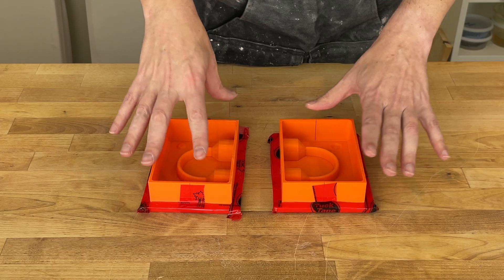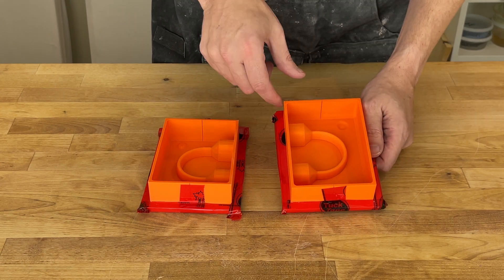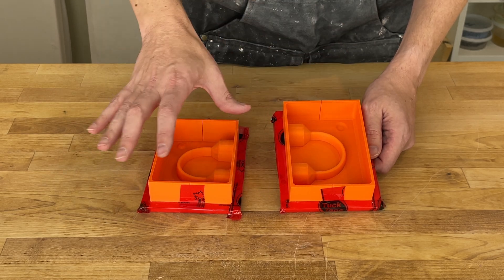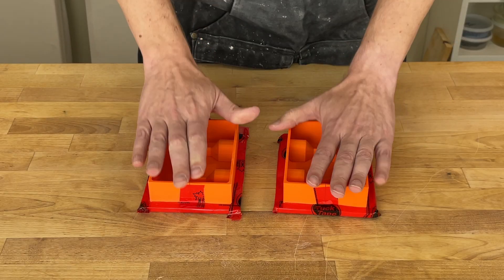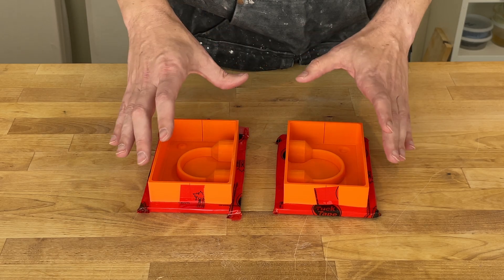Next up is to mix up plaster. For the handles I have up on the ShapeCast website I compute that for you, but for this one since it's a prototype I didn't do that. I just computed the volume — length times width times height times two — and that gives me the volume of plaster I need. I'm going to do a couple pours at once. It's hard to mix small amounts of plaster without introducing bubbles; counter-intuitively, the larger the volume you have the easier it is, so you don't suck air into the plaster as you're mixing it.